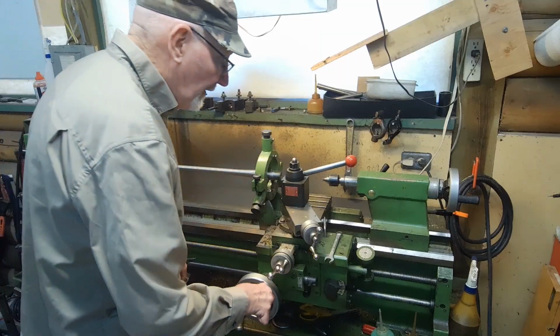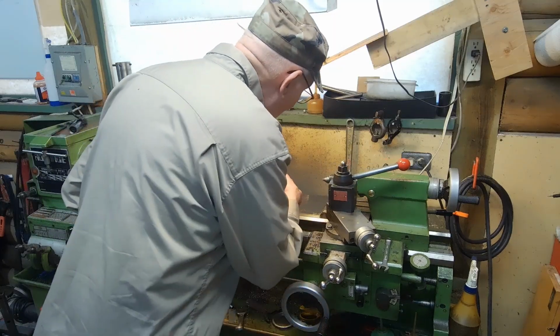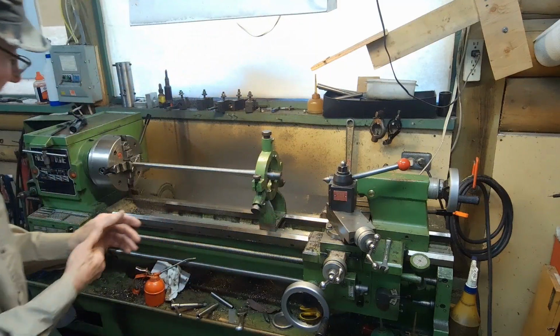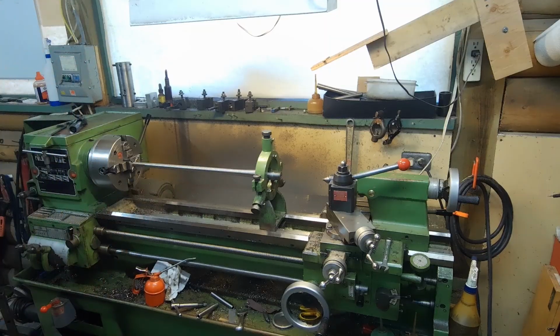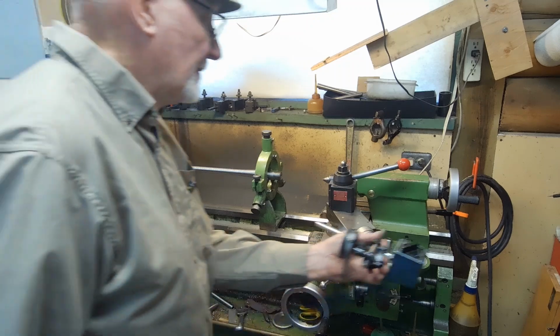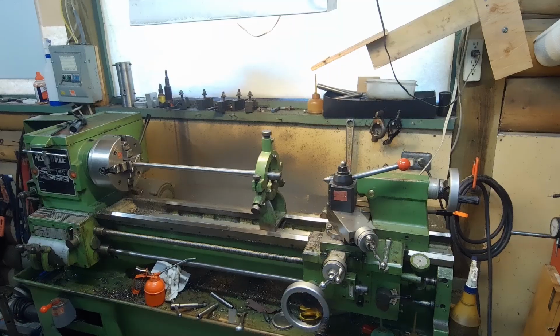Anyway, for now, all I'm going to do is just quickly check this. And now we know that this center that we cut in a previous video was absolutely zero. There was no run out whatsoever in relationship to the bore. And we'd like to maintain that happy circumstance. And if we don't, then that'll give us the opportunity to do things another way.